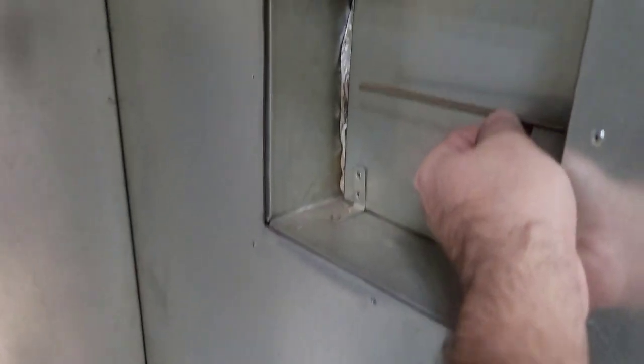I have the thermocouple, I think they call it, for the control box right here. I'll put it in the middle, so it catches that cross convection going across and gives me the best temperature reading in that center. So far, again, this oven will pretty much keep consistent temperature all the way through. All four corners are pretty much damn near the same.